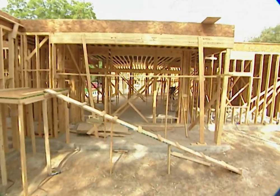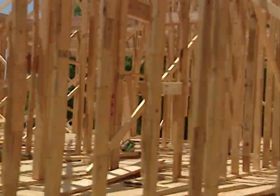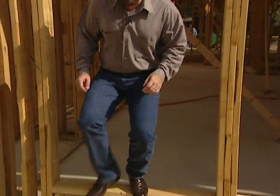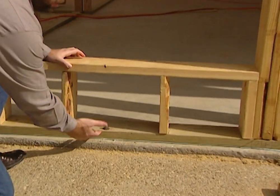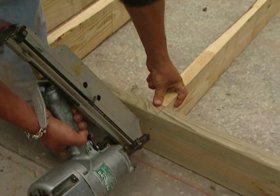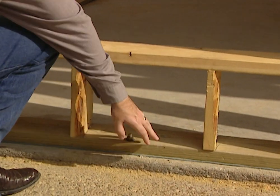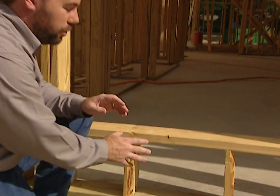It's hard to believe we poured the concrete just two weeks ago — we're well into the framing stage on the 16,000 square foot monster. Framing starts from the ground up, beginning with the base plate — the board along the bottom that all the studs are nailed to. Ours is southern yellow pine from Georgia Pacific, but this base plate is pressure treated, a different color because it has chemicals to help prevent weathering, moisture damage, and termites. Termites won't eat this pressure-treated plate; once they hit it, they turn around and go somewhere else. Whenever you're building a house, you want a pressure-treated base plate.